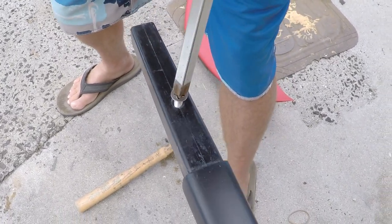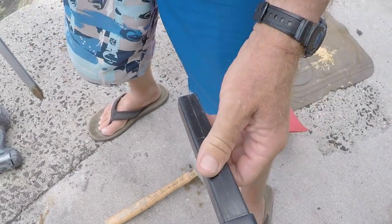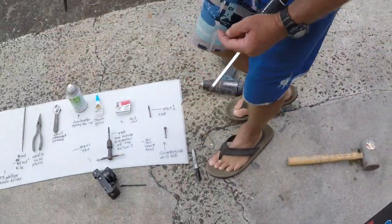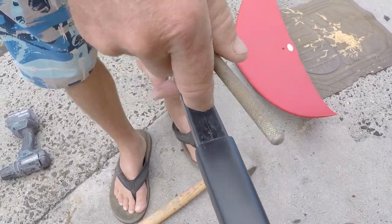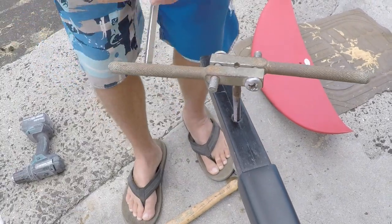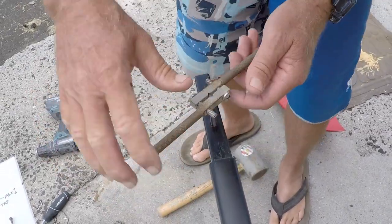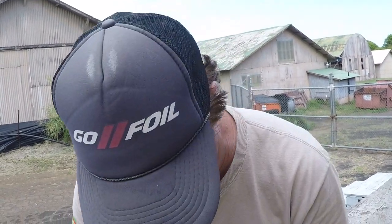Now, if you're at this point, you've got it pretty buggered up. You could run your tap right through this right now and clean it all out again. You would take your M6 tap and run it right through here to try and clean this up again. But our whole idea is to show you how to do the helicoil all over again. If you're at this stage, get a tap and try to clean it out before you proceed anymore — you might be able to not totally replace the helicoil.